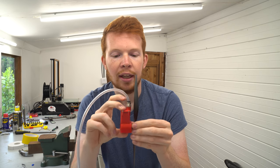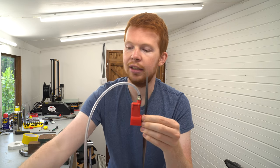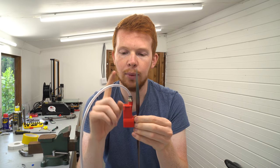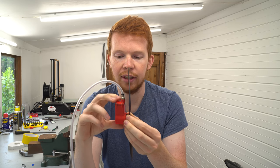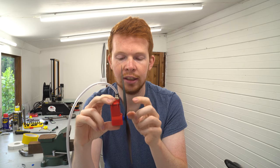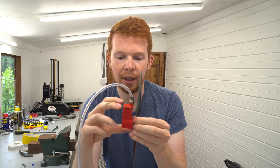So the pushrod, instead of running up the rear of the engine, is now running up the front of the engine. Now, there's also this modified cylinder head, which allows me to mount the pressure source separately from the engine, and I was trying to find out a way of gluing PVC tubing to PLA plastic, but I couldn't really find a good source, so this press fit pneumatic fitting makes my life a lot easier, and it simply threads into the 3D printed part.